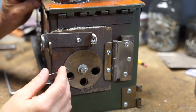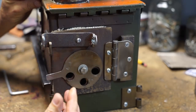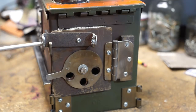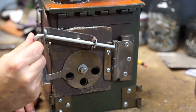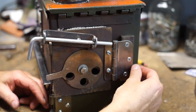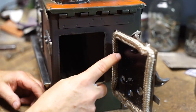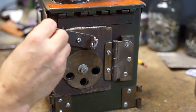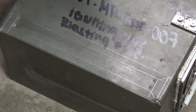As far as opening and closing the stove, it's this piece here. When it's cold it's pretty simple — you just go like that — but when it's hot I made this little piece so that it goes through like this; you don't burn your fingers opening and closing it. There's also a little piece here which extends the door out, and the reason being is I had to allow for the fiberglass insulation that goes around. It's a slotted piece, so this fits into the slot and there you go.